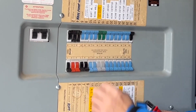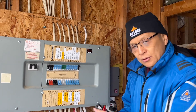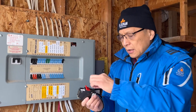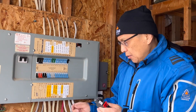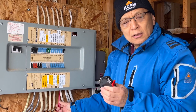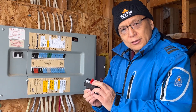Recently I had a 24,000 BTU heat pump installed, and this heat pump needs a 20A circuit breaker. The good part is the previous house owner had wired the AC circuit with AWG12 cable, but somehow he used a 15A circuit breaker. So today I just need to replace it with a 20A circuit breaker.